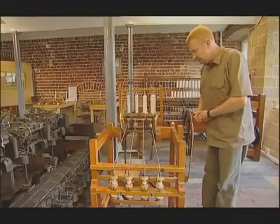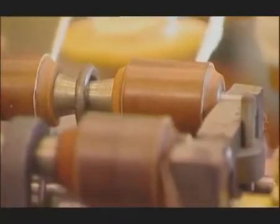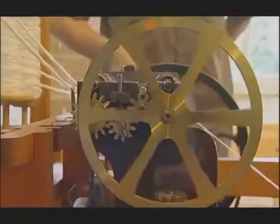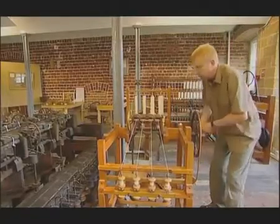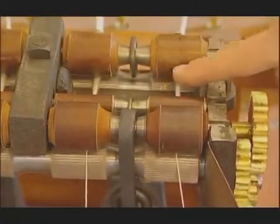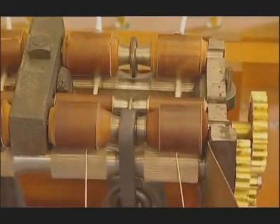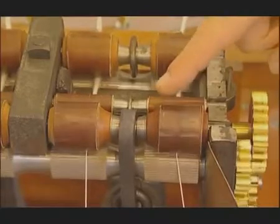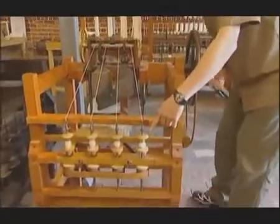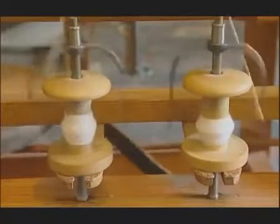As you can see, it's quite a simple machine. Turning the belt drive draws the yarn through three sets of rollers, rotating at different speeds determined by the gearing mechanism. The weights put the stretching yarn under different degrees of tension. The second roller runs at twice the speed of the first roller, stretching the yarn to twice its length. Then the third roller runs at twice the speed again, so doubling the length of the cotton again. Finally, the spinning spindle puts the twist in the yarn. It's quite a beautiful action.